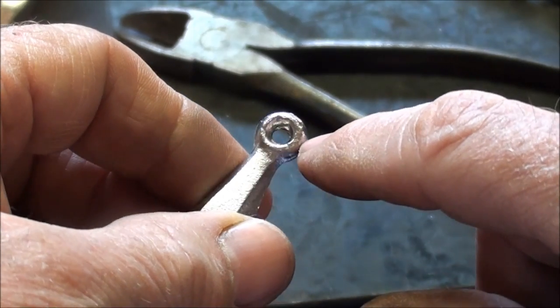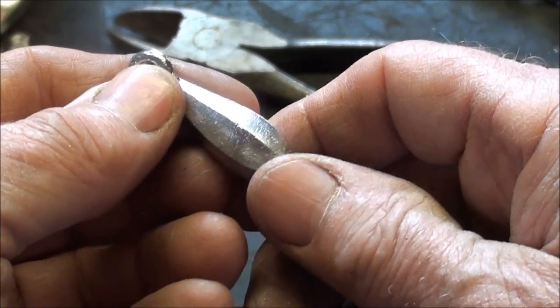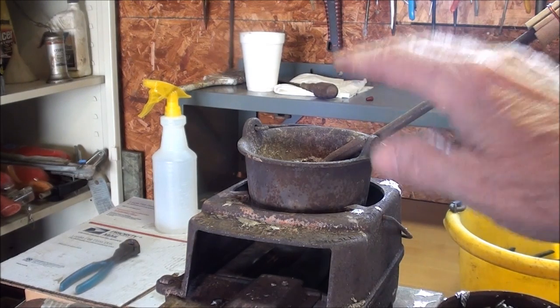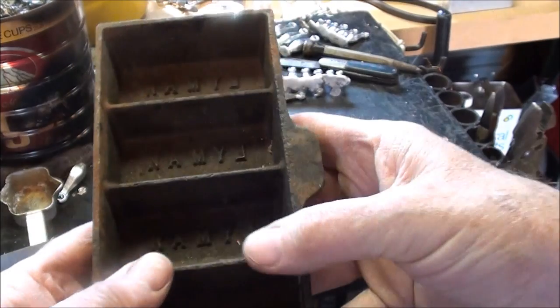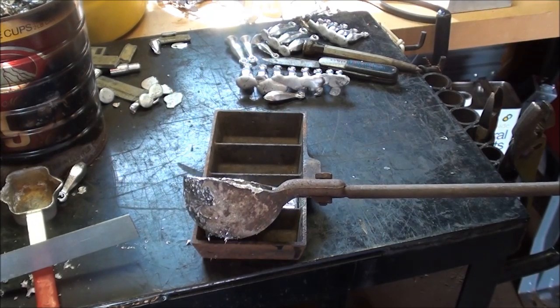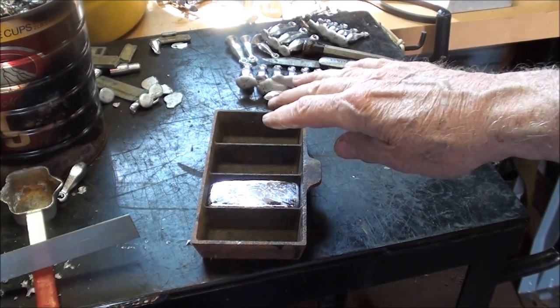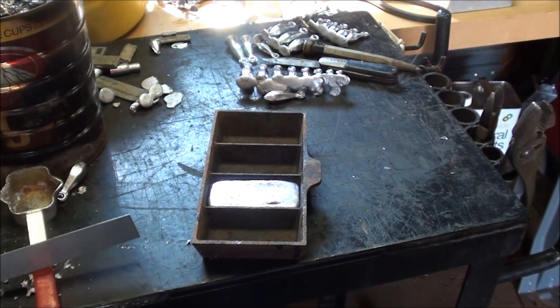You can file off any flashing along the parting line. We lose a lot of sinkers in the rivers around here because of snags. When you're done and still have lead in the pot, you can let it solidify in there, or another option is to use a little ingot mold. This is a Lyman ingot mold — Lyman is a bullet supply producer. Let me fill one of those cavities. This batch of lead is getting pretty chilled off so I barely made it without it solidifying in the ladle — just like making muffins or a little loaf of bread.